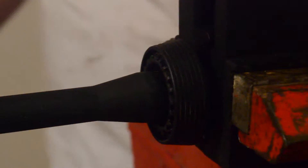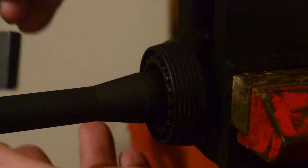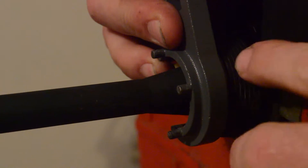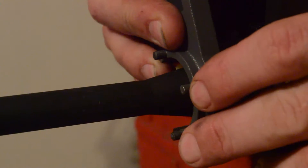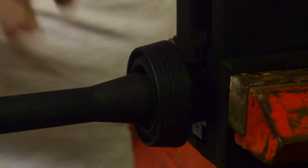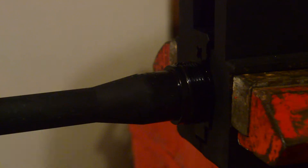Here's my old delta ring assembly, and I already broke it off. On the military style with the teeth, you use that side. On a lot of the aftermarket ones with the holes, you'd use that side. When you put it in there and get lined up, you want to press in to make everything fully engaged and make sure that spring doesn't pop off. Then you want to break it loose — it's held on by between 30 and 80 foot-pounds — so it might take a little bit of effort. Then you want to screw the new one in.